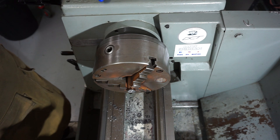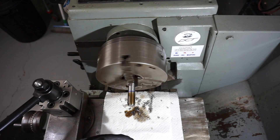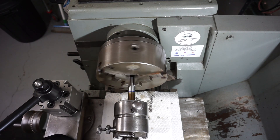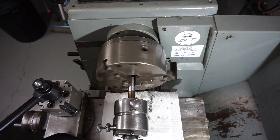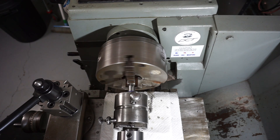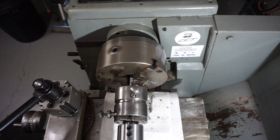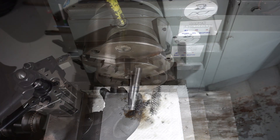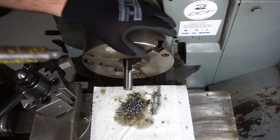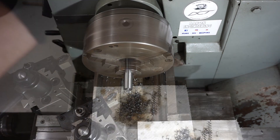I've put it back into the three-jaw chuck and you can see where I've put my mark where the thread has to go to. I'm using the three-quarter inch Coventry die at the moment. I had chasers for three-quarters of an inch BSW for this little three-quarter die and it was beautiful — it just fed straight in on the one setting. I didn't have to do two cuts with this and you'll see it disengage. Quite a lovely thread. Then it was flip it around, back in the other side of the chuck. I wasn't holding on by much and I didn't really want to grab onto those threads because otherwise you run the risk of damaging the threads, especially if the stud moves or starts to slip in the chuck.